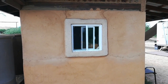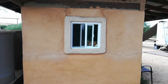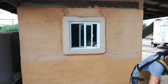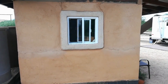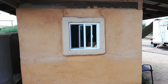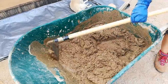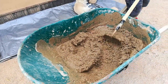This is what the wall looks like now that the entire base coat is complete. You can see there's a little bit of a tonality difference between the first day and the second day — you'd have to get really super exact with the amount of colorant to get the same tone. Whatever the case, we're now going to begin with the fun part: applying the adobe hemispheres to the wall. We've mixed our batch, very similar to the wall recipe but with 75% less straw, double the Portland cement, and double-sifted dirt to make it less granular.